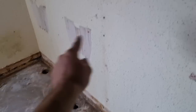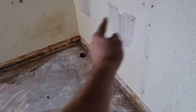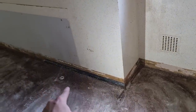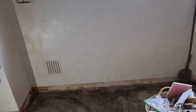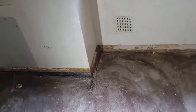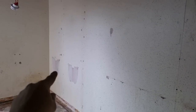On the drawing it shows this floor being broken up and the drain picked up off those two, with just one pipe feeding all the toilets — I don't think that's a very good idea. We've run the sinks on the other side and we can hear it in those drains, so we can't just elbow it there because those drains feed further back. What I think we should do is break the floor up here, find if there's a four-inch pipe going along there, bring it up in the middle, and go both ways using a four-way tee with an air admittance valve in the middle to feed all four sets.